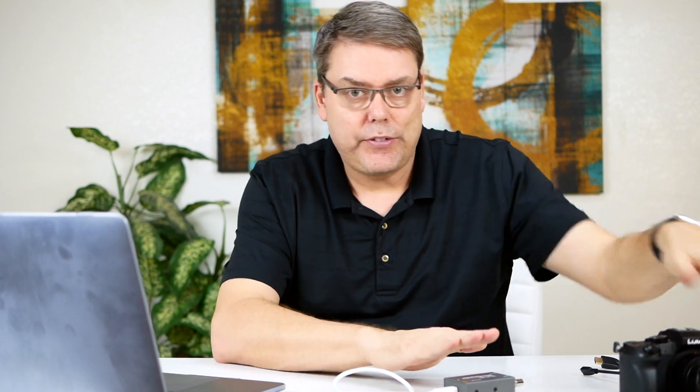Here's the key: if you keep everything connected when you start — this is the mistake I had. I had my gear all set up, I had the camera plugged into HDMI and into all this stuff. I had it all set up and it would just not work. And then I'd have to get up and unplug the camera and go back and forth until it would finally sync up. So: plug in the Mini Recorder first, turn everything on, and let it get recognized by the system.